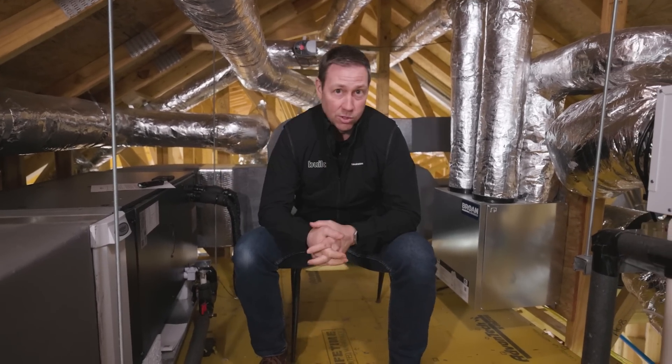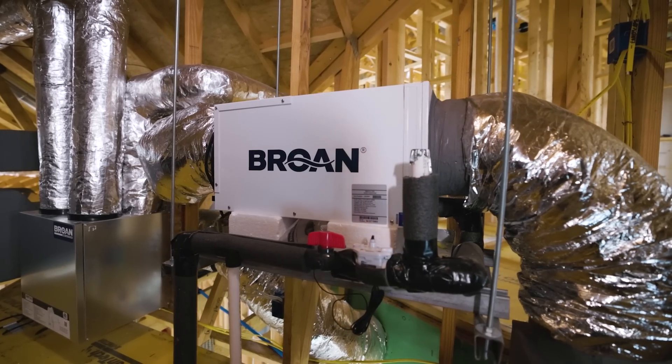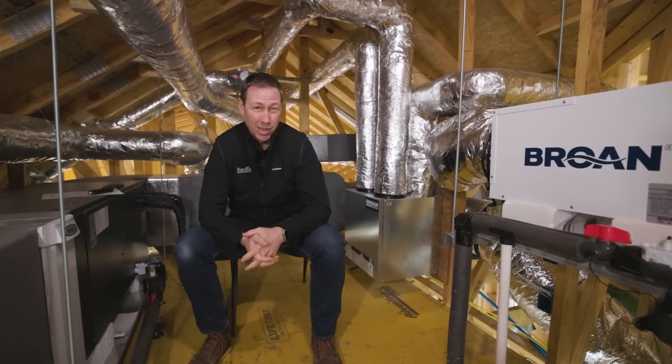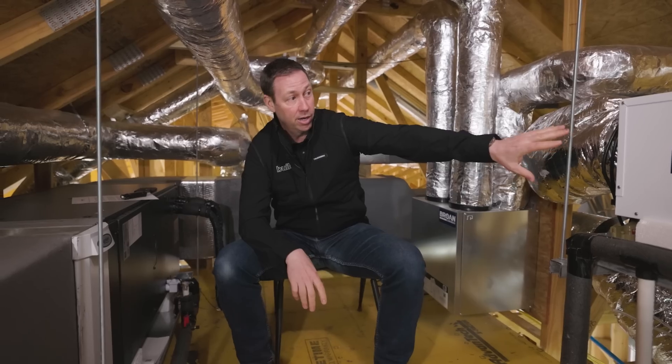So here's the deal. This video is intended for you as builders, but I could see you also forwarding this video to your clients. I really want to make the case for why you want to add potentially a dehumidifier — a whole house dehumidifier — not the kind that plugged in in the basement to keep it from feeling musty. This unit is intended to actually keep the humidity in the house lower year round, and it's ducted, so it's part of our HVAC system, but it's different.